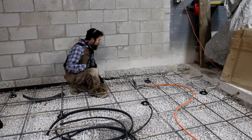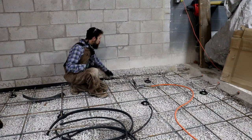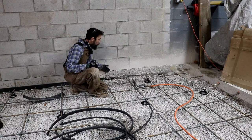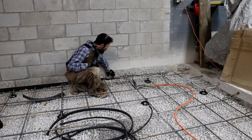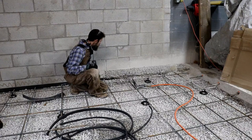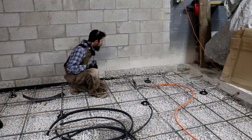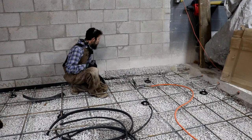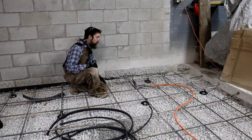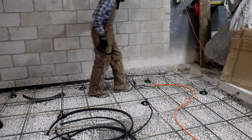So I've got some work that I need to do along this back wall before I can put my expansion joint all the way across it. Where I cut out this center section of pad, I couldn't get my wet saw completely flush against the wall, so it left me with a portion of the old concrete floor sticking out from under the wall a bit. And that stops me from running my expansion joint completely against the wall. So I'm going to have to use the air hammer and chip that out a little better. That way I can get a good flush joint all the way across the back of the shop, and it doesn't look funny on one side versus the other. Not that that really matters, but I'd like for it to be a little neater than it would be otherwise if I just left it like this. So, air hammer it is, even though it's not my favorite tool to run. Sometimes you have to.